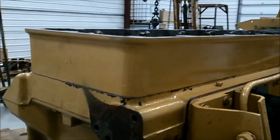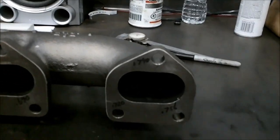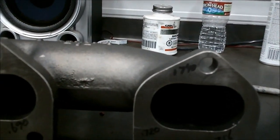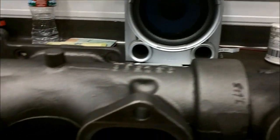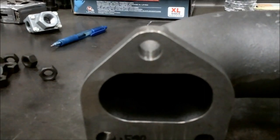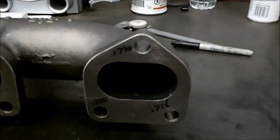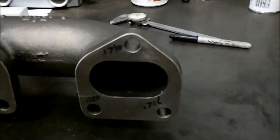This is my awesome one-thousand-dollar CAT manifold. I measured the flanges — this one out here on the corner measures 756 thousandths, then 720, 740, 690, 660, 660, and it just goes down and down until you get down here and on this end it's 590. So you've got almost 200 thousandths difference in the flange thickness, and on this end I can only get about half the threads of the nut on that stud. I hope it holds.